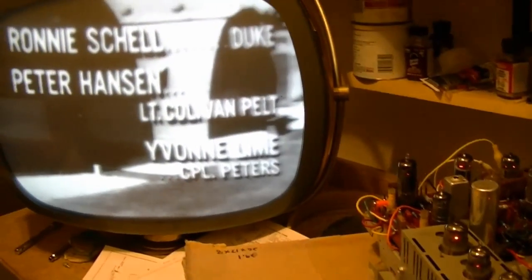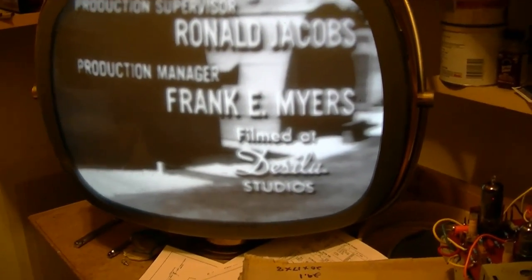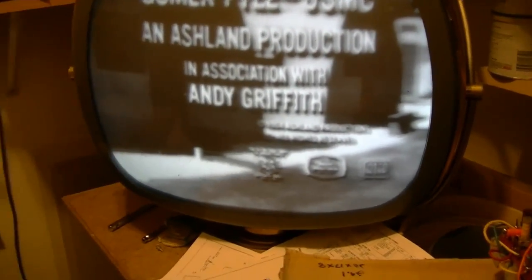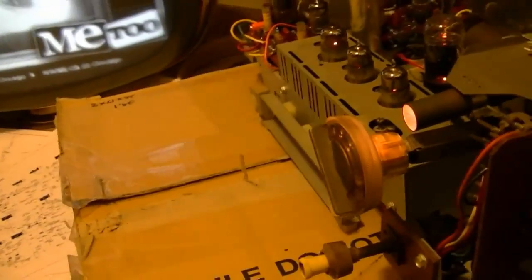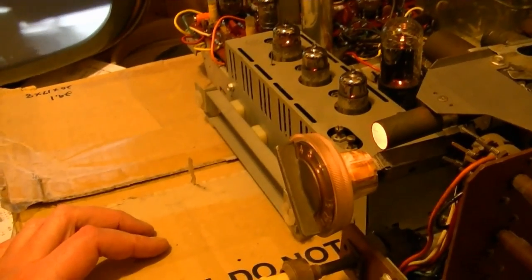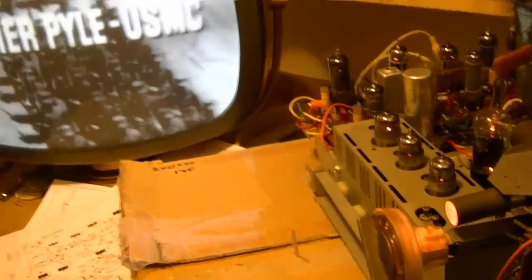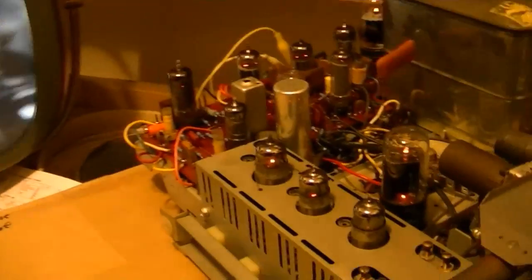All I need to do is adjust the fine-tuning a bit and I can actually get rid of the buzzing. I don't think I'm going to bother with alignment on this side, but certainly not until I put the new old stock picture tube in. It's been running about a half an hour now, and if anything, the picture's actually getting a little bit worse. In a few days the replacement power switch should be here, so I'll rebuild that control. And as I said, I'll have to work in the IF strip. But in the meantime, I am going to start working on another tandem set — I just had so much fun with this one, I can't wait to do another one.